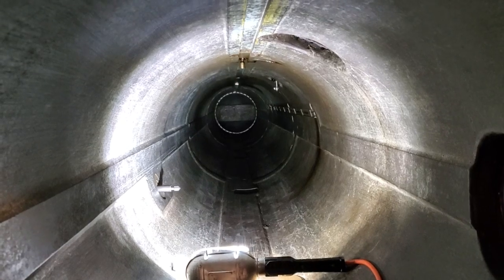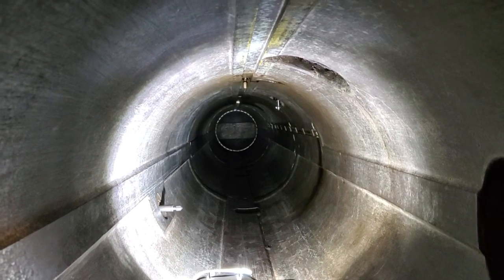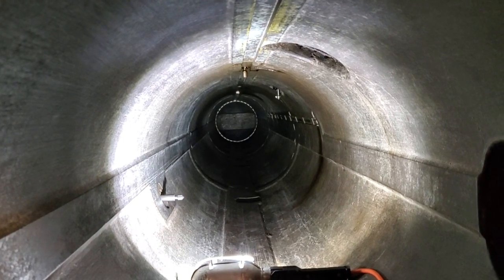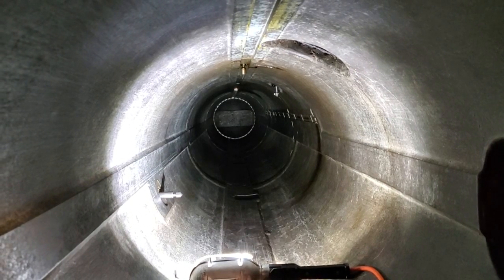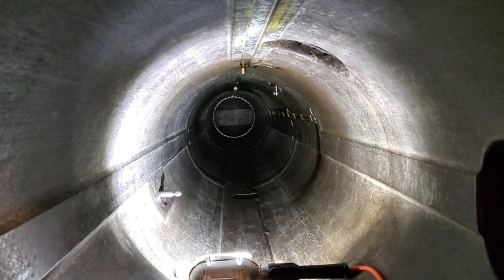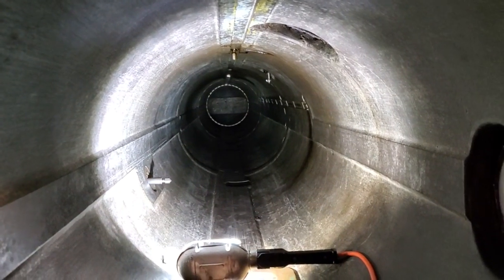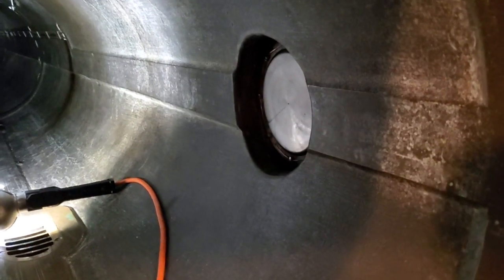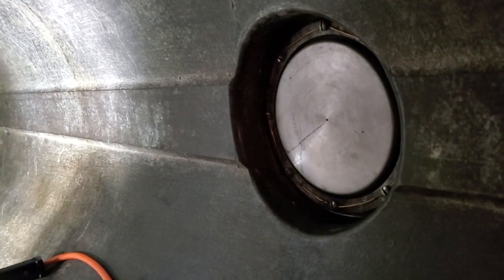We just discussed our light switch on the after body of the torpedo, but something in there has to interact with that switch to get it tripped. So the torpedo engines — or in the case of the Mark 18 electric, the motor — take over and propel it out the tube once the impulse air has gotten it moving forward. I'm going to have Evan pan a little bit to the right to show that little poppet valve right there. That's where the air pressure is introduced in the back end of the tube to blow the torpedo down the tube itself.